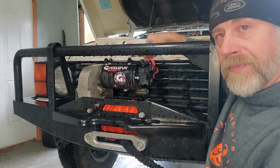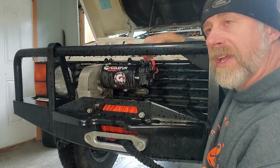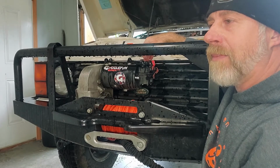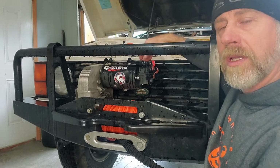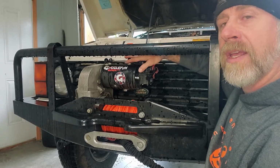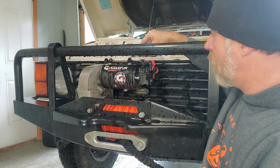Always use copper cable. 2/0 is what is on the high end for the bigger 8-horse motors and stuff like that. If you're getting into dual batteries, pushing a lot more power around, 2/0. 1/0 is usually good enough for a winch setup like this, where you still want a lot of juice going to that motor to keep it fed, but you're not running a crazy dual motor setup, pushing 24 volts and all that sort of stuff.